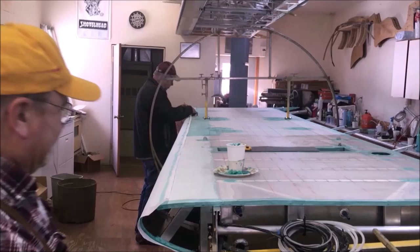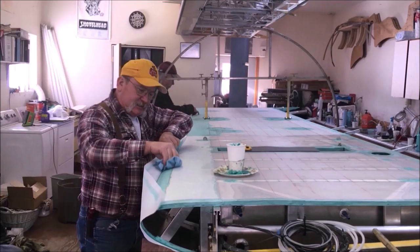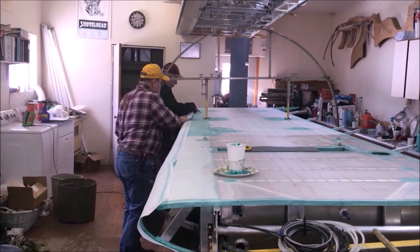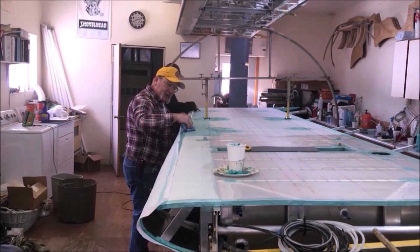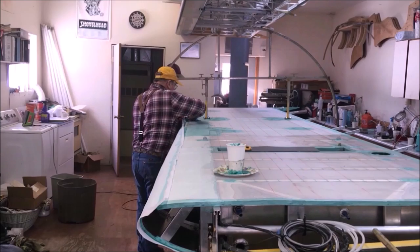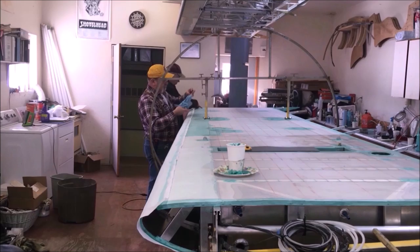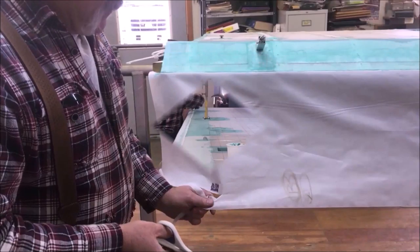Okay, so as Mike is doing that, I'm gonna come behind him and wipe all the excess off. Don't need it. It'll dry a little quicker and make it easier to cut a little faster if I wipe it off with a dry shop towel. I've got a good bed of Eco Bond underneath it to lay down into and to grip our leading edge fabric. Then we'll give this 5 minutes or something like that to dry up, and we'll be ready to cut.